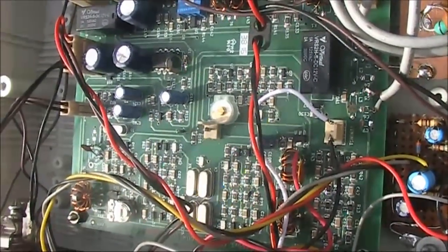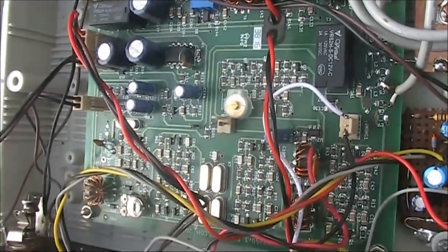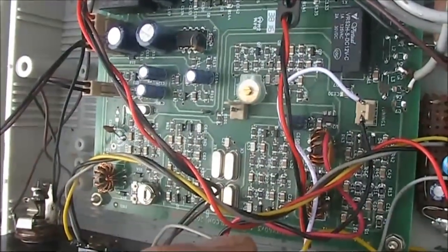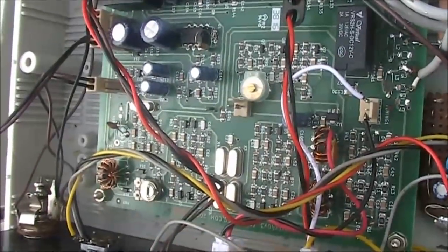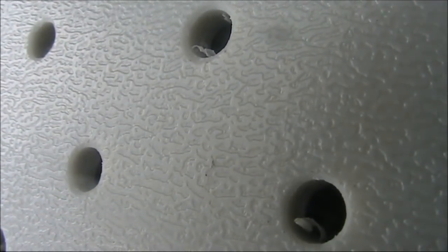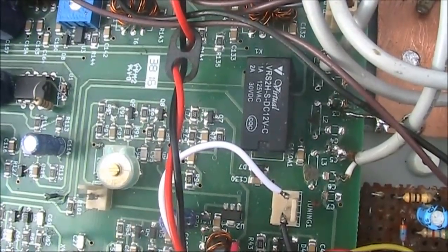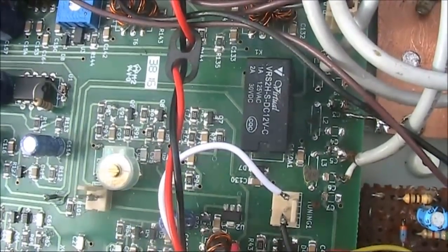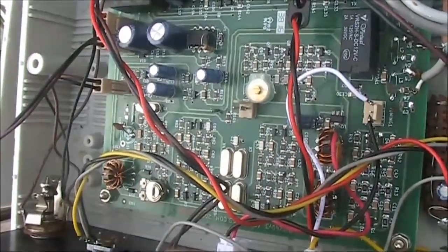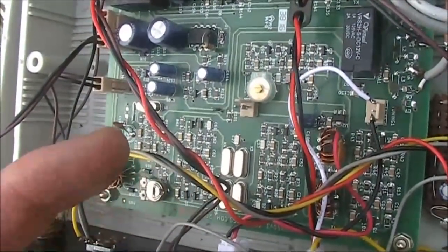Another possibility is through power connections. Remember that the 12-volt supply rail is common to many parts of the circuit — whether it be a DDS VFO, receiver audio amplifier, transmitter final amplifier, and many other stages that handle varying levels of signal. There's also a possibility of noise making its way by being coupled through to sensitive parts of the receiver, for instance RF or IF amplifiers. Coupling through the power supply rail, even if only a few millivolts of signal, can affect the performance of sensitive RF circuitry.